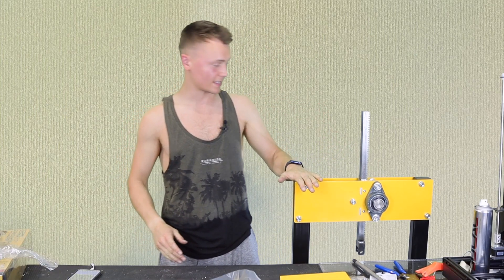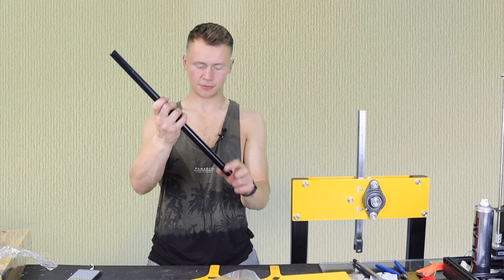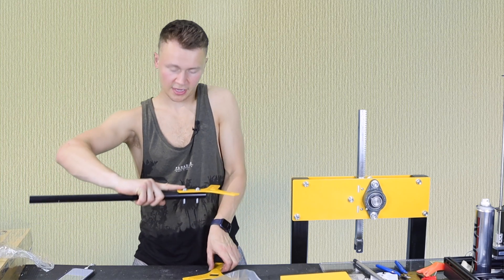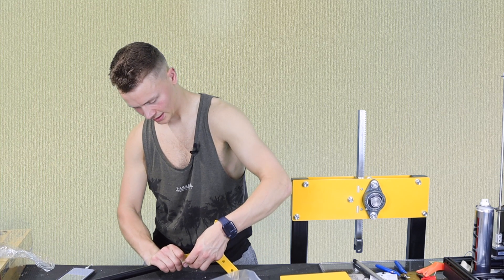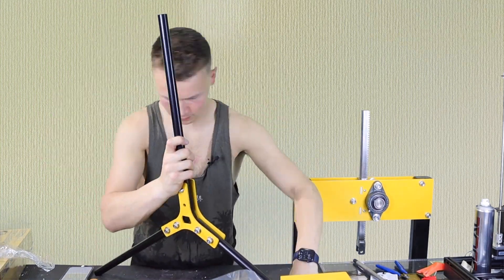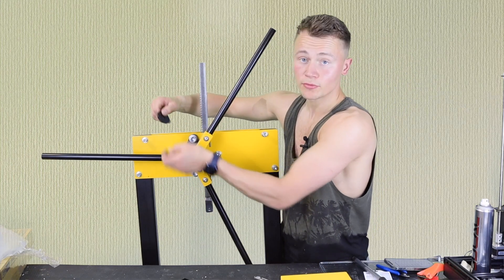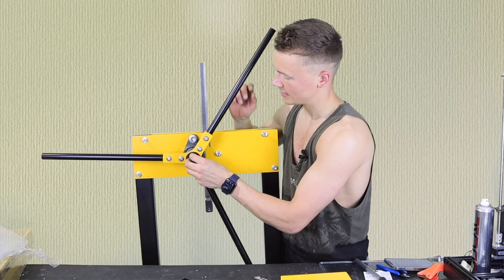That's now completely on the floor, so you can see the exact height. Take the two yellow handle pieces and three black handles using M8x40 bolts. Place these pieces onto the handle with a washer, through the bar, through the yellow piece on the other side, then another washer and an M8 nut. Do the same for the other three. The handlebars attach, then take the ring, set the M8x20mm bolts through, and put it on to hold the handle in place.